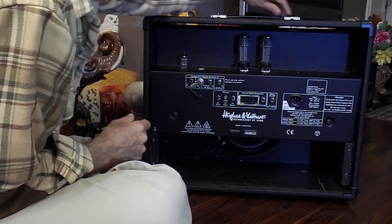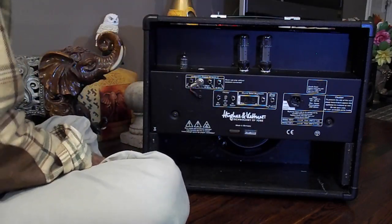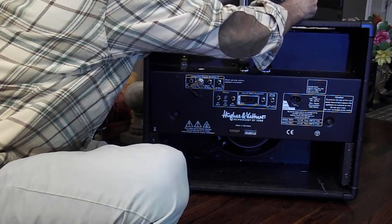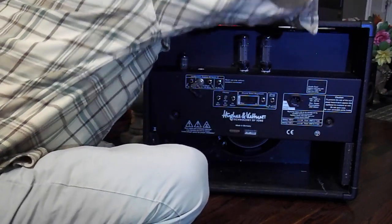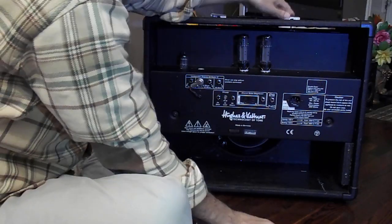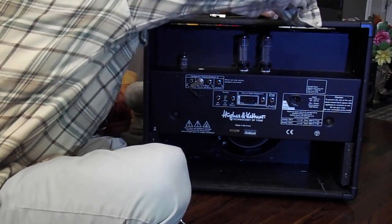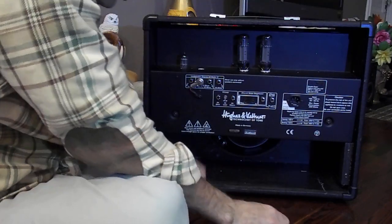So once you get these screws loosened up, the chassis is going to drop a little bit and fall on these pieces of wood here. You're good to go. Take these screws all the way out, if you can, so they don't interfere. Pull the chassis out. There's one screw. No big deal, just come off. Everything falls back in place. There you go. 2 screws out.